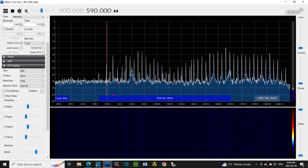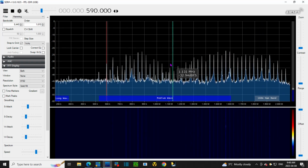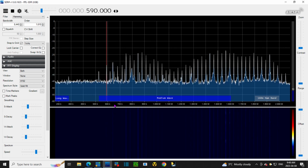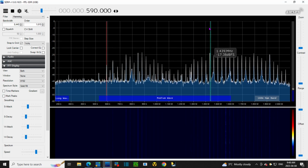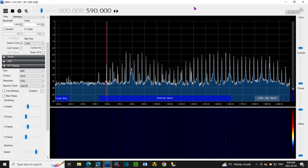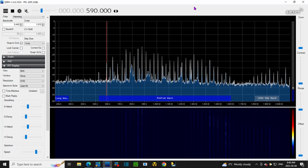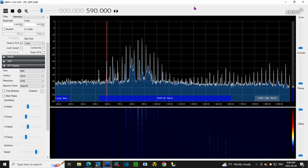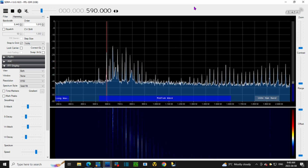Okay, so this is the sort of distribution of reception, but this may reflect the signals that are available. Like this low point here may just be because that's the way it is. But I'm now going to tune the antenna and watch what happens. So I'm at one extreme here, and I'm tuning now. Tuning. There we go. I've hit the end of the road. So I've tuned the capacitor from one extreme to the other.